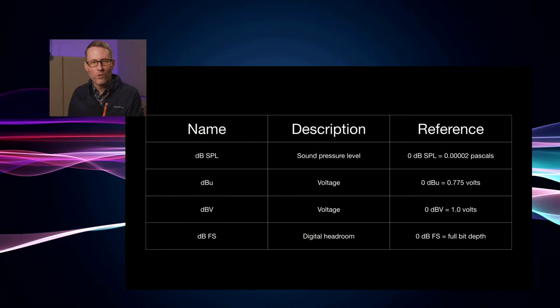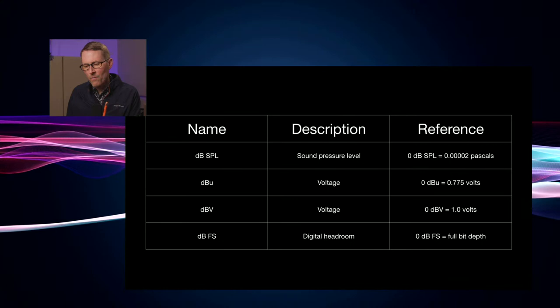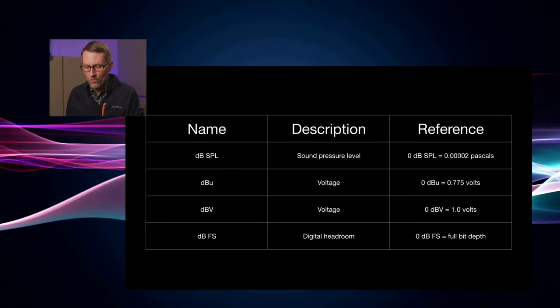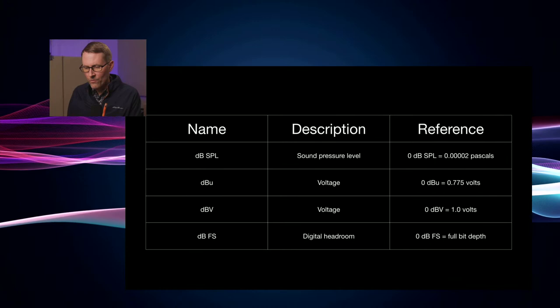And so you're less likely to see that as much on professional audio equipment, but some of them are switchable. In fact, I think on my Shelford channel here on the back, there is an output. If you wanted to, you could get a minus 10 dBV output, which is basically consumer line level. Whereas typically professional line level is considered plus 4 dBU. So they're just measuring it different ways. Nothing else magically different about it. The consumer line level is basically at a different voltage than you'll typically find for professional line level.